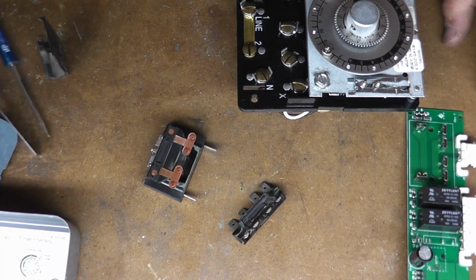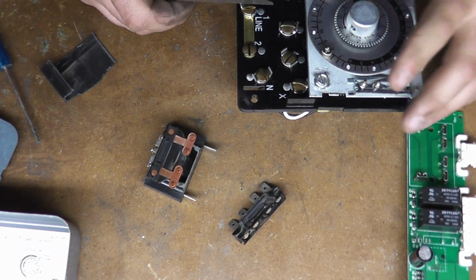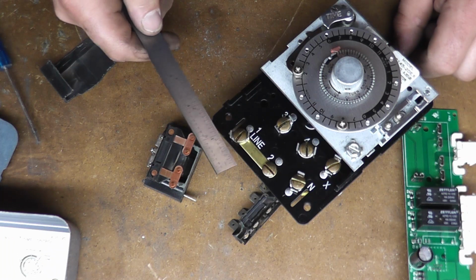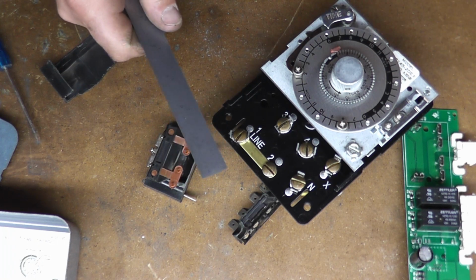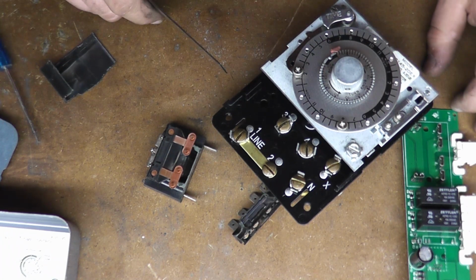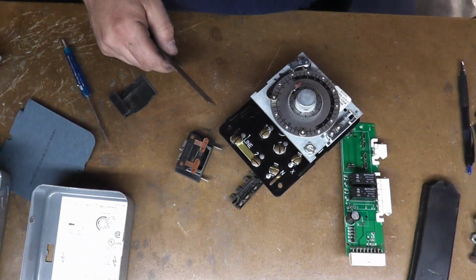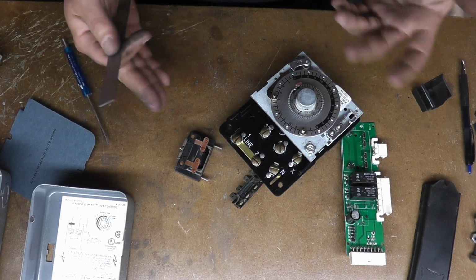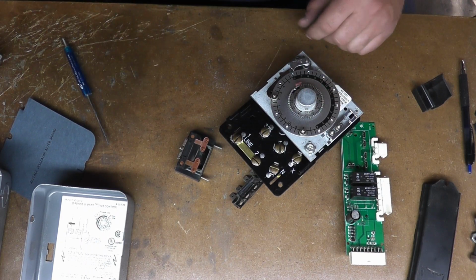But we see a lot of this stuff around where all kinds of digital stuff is thrown in where it's absolutely not needed. Case in point is the newer Trane units. Most rooftop units have belt-driven blowers, which is just a 3-phase motor, and it's belt-driven, obviously. Usually they come set up at the factory for whatever CFM they supposedly need, but you can adjust the speed a little bit by putting new pulleys on it, or they usually have adjustable sheaves, so you have a little bit of play in the speed of the blower wheel.